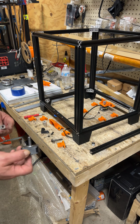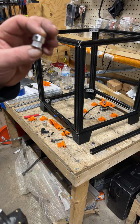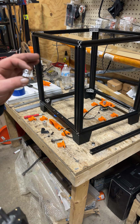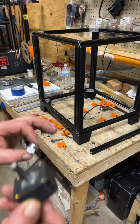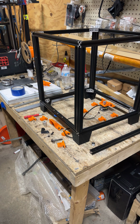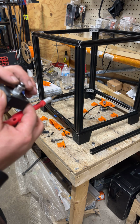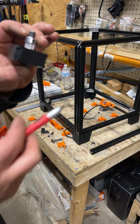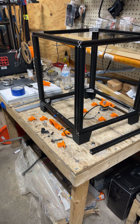And then we're going to need our 20 tooth, and in fact, I better say this right away. Whatever you have for teeth on your stepper, you have to match on this fake stepper. I don't like playing with these steps, so I just went with the stock 20 tooth. So we're going to put our thumb on the bolt and kind of hold it down. You don't want to squeeze this real hard, but you don't want to have up and down slop when it's tight.